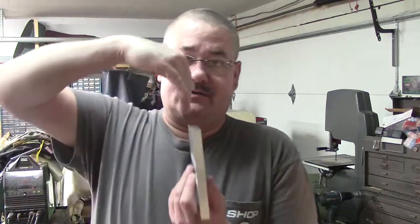use one of the bits. And it's got a little bit of a scallop, and I'll pan in on it here in a little bit. But what I did is figure out what feed rate works well on this. It's 2.5, which is kind of odd because that is what worked great when we were feeding the 3/4 end mill, doing the tops of these, trimming everything down.